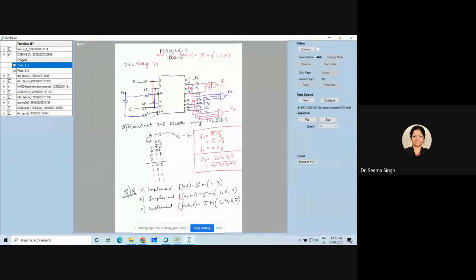Because BC repeats itself two times, B and C are connected as both 1A, 2A, 1B, and 2B — they are shorted together across both decoders. The third variable, the MSB 'A', cannot be connected as a regular input since the 2-to-4 decoder can only handle two inputs. So instead, the third input A is connected to the enable pins.